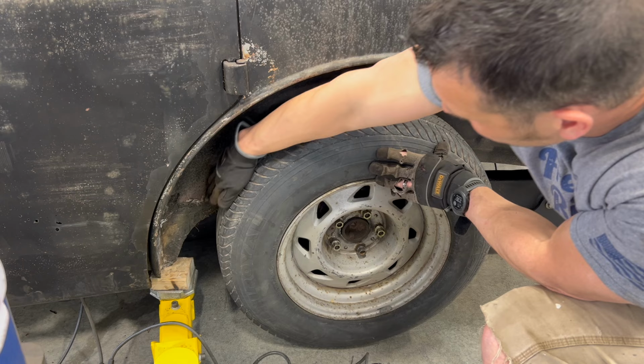I measured this. Our distance here behind the engine is about 10 inches that I can move that to the rear. So our whole drivetrain here is gonna go that way. Then we're gonna have to get inside of it on the floor so we can redo the rocker panels and everything. And in the back here, as I said, we're gonna get in the trunk and I'm gonna cut the floor of that out because I will bring it down lower in here in a minute.